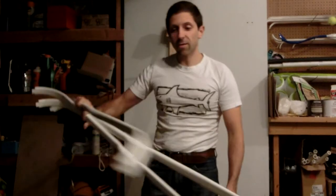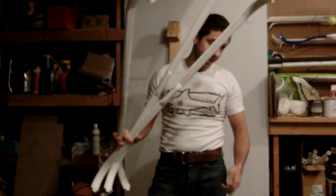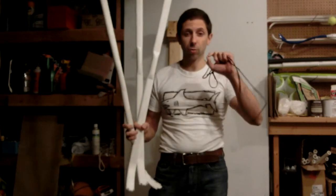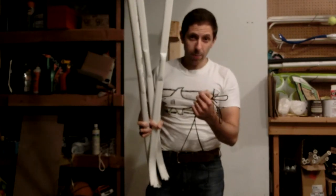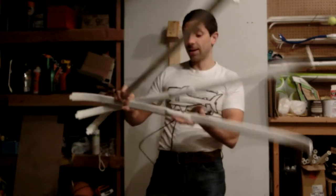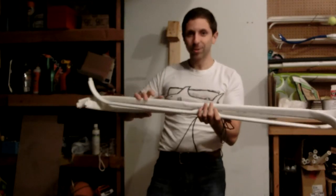Hello YouTube, Tim here, and I'd like to show you one of the projects I've been working on. Here are several of the bows that I've precision flattened. I used a jig with screws I could adjust the depth of. I measured the depth with calipers, then I flattened the bows. Each limb should be identical.